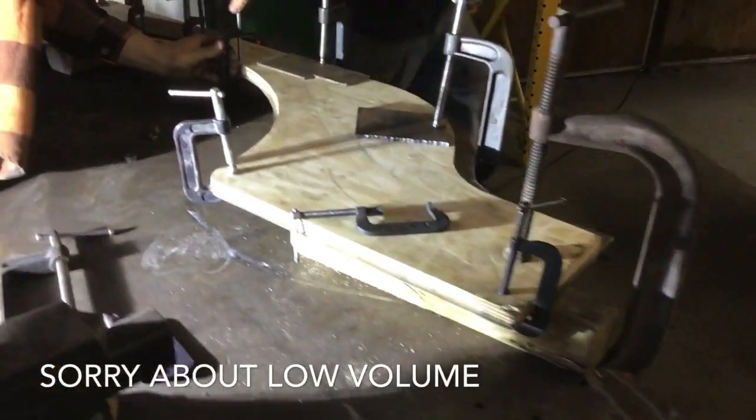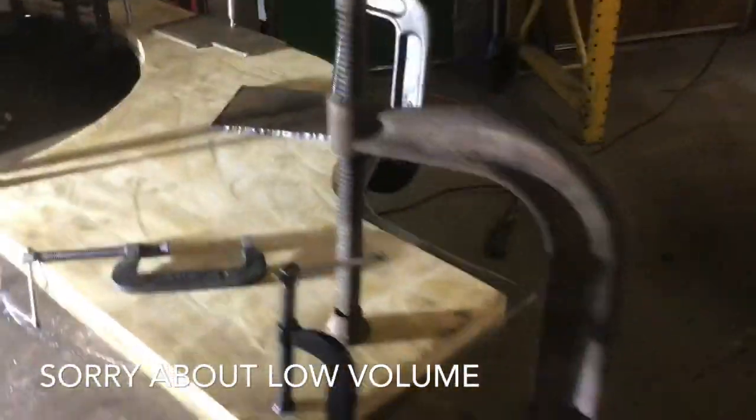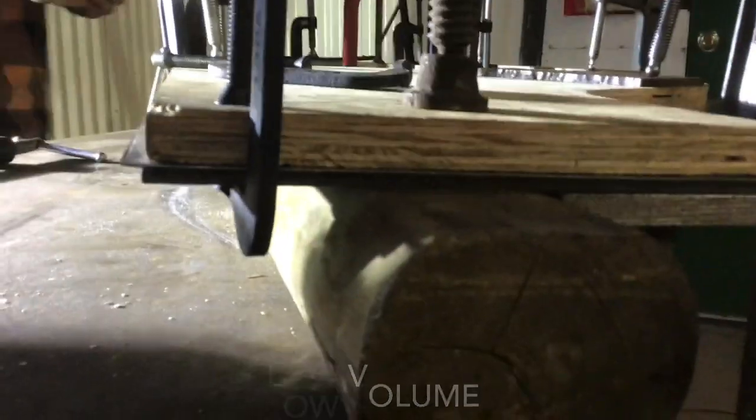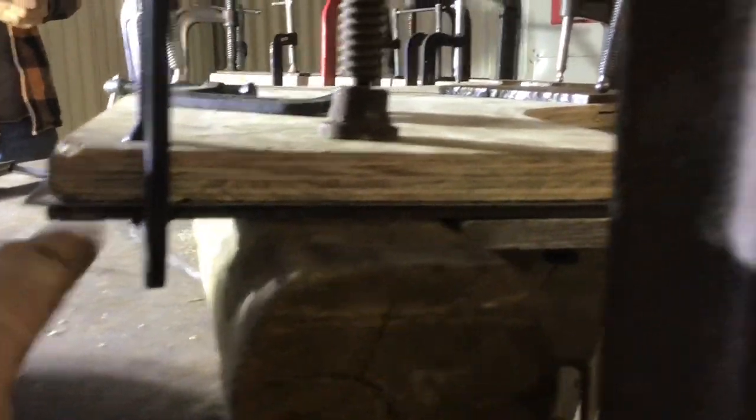Here is the hammer form setup for the quarter panel. This is set up to do right or left. And unfortunately, we didn't have 3/4 inch thick steel, so we made it. Ted made it out of 1/4 inch plate, and then added right there a 1/2 inch plate. That 1/2 inch plate is actually bolted on, so it can be taken on and off and put from one side to the other.